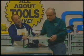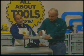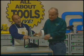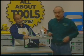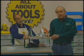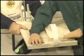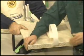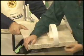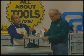And all it takes is you sit here and put your adhesive in your line, break your edge over, fold it, put this clamp on here, put it on this rail, and you can adjust your tension by how high you rise this clamp up on your front edge. So if you think you're getting too much, you can push it down towards the bottom a little bit. This will give you a perfect miter fold edge every time, and it won't overclamp. I know a lot of fabricators have problems of breaking their tape because the guys have cranked the clamps too much. This is like the best and most perfect way. And this keeps a constant tension on that as well.